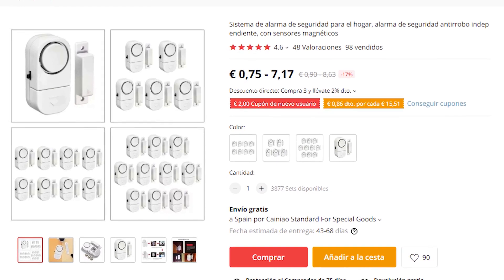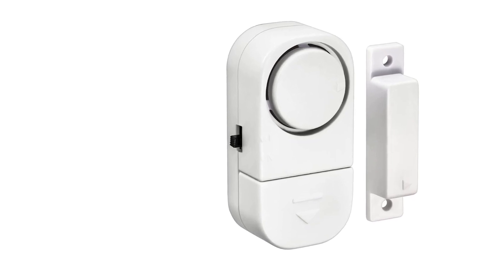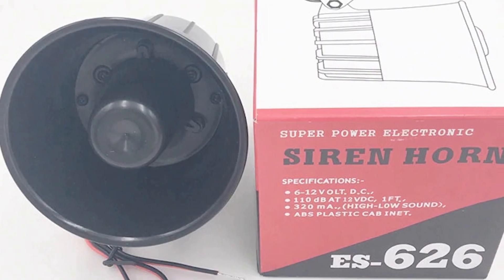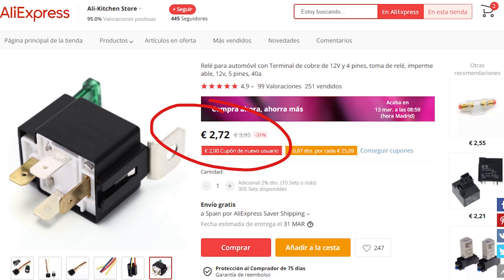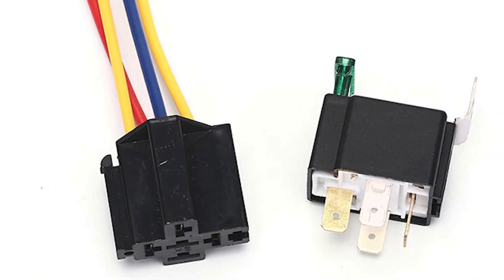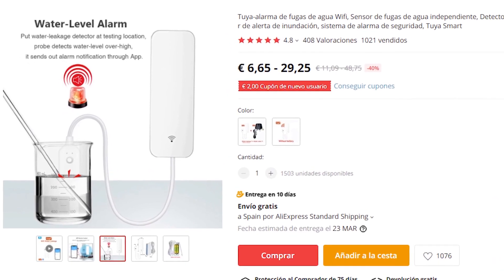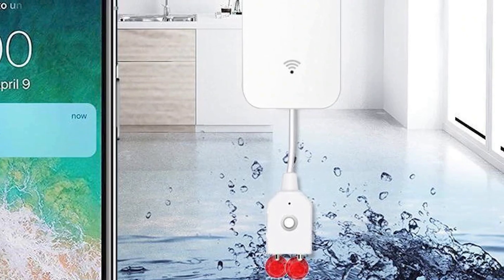These float switches close a circuit when they float due to water, enabling us to connect whatever we want on the other side. We are going to see two options: the first is to buy a small siren and modify it slightly so that it activates with the float switch. If we're a bit hard of hearing, we might opt for a much louder siren. Since the switches are designed for very small currents, we can use a relay to connect a very loud siren or even the bilge pump. For when we are not on the boat, we will buy the most important thing: a bilge water detection sensor costing less than six dollars, which through the boat's Wi-Fi will send a notification to our mobile phone.